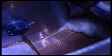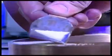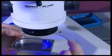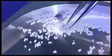The spheres of the new ball bearings are not made of metal, but ceramic. Extremely hard, ceramic spheres have the advantage of being able to run without lubrication. In addition, they are much smaller than the metal spheres used for mounting rotors nowadays, which means that ceramic spheres can also be used for mounting very small rotating parts in the watch movement.